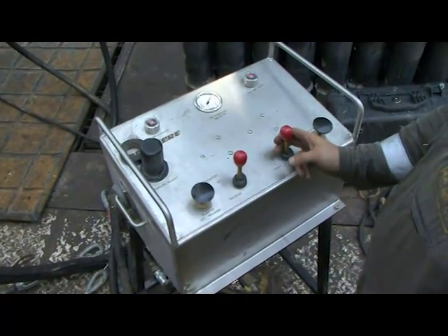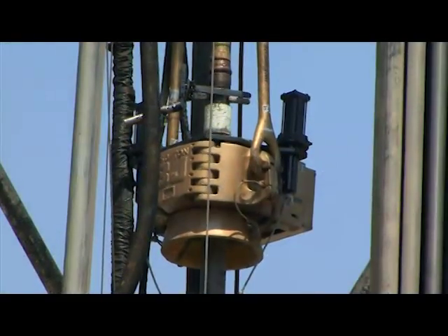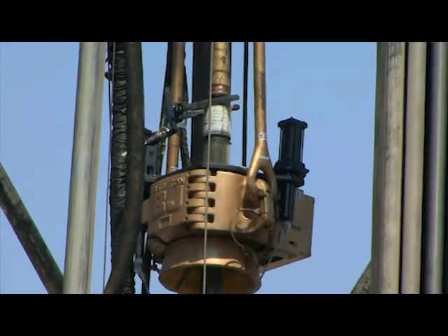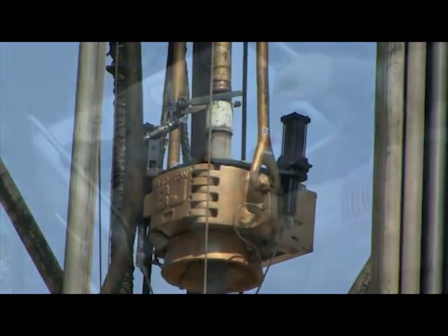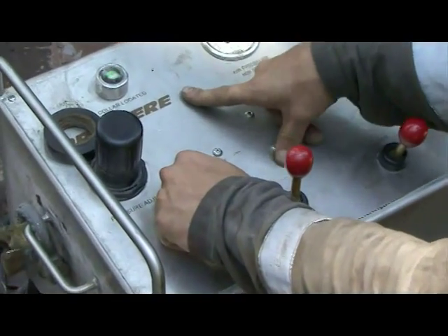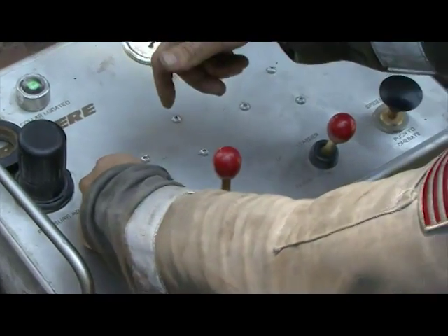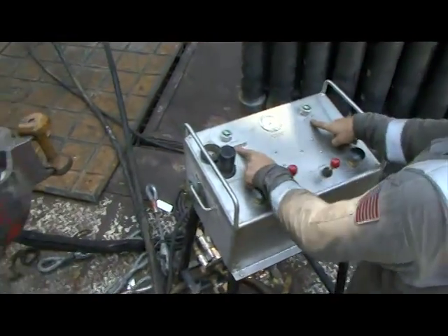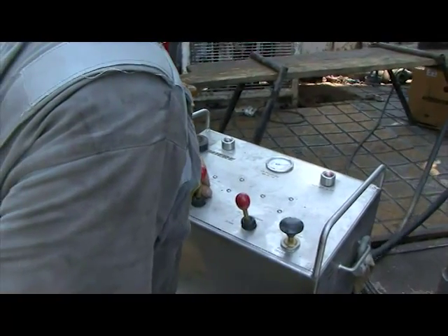This, however, will not cause the elevator slips to set. This places the PSE control panel in a state where it is looking for the signal from the elevators that the collar locator has indeed found the top of the collar. This will yield a green signal on the collar locator indicator seen on the top left of the control panel. Additionally, the elevator slip set indicator eye will show green, verifying that the leveling arm attached to the slips is in the proper position.